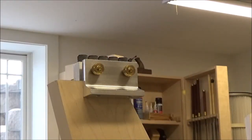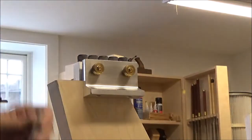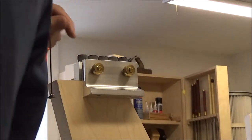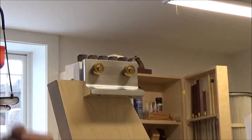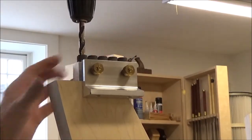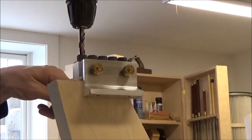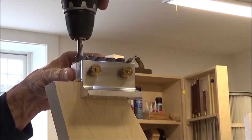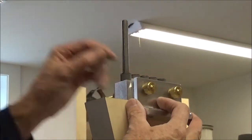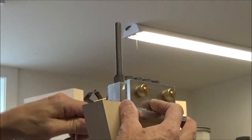With just the right amount of shims I'm able to use my dowel jig here — the Dowel Max. I first found center and dropped my three-eighths transfer punch into the mark I made, and it's near perfect. With the built-in slop I have, this should be just fine. Got this locked in place.